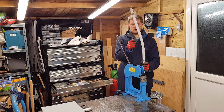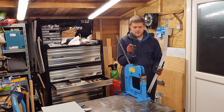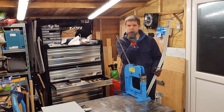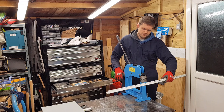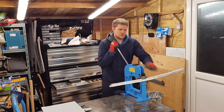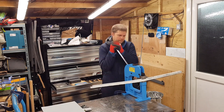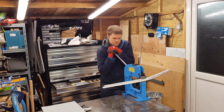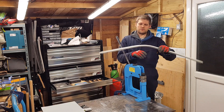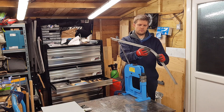You can see there — I've shrunk this section. These are shrinking jaws: as they come together, each jaw has two separate parts and they pull together. There's a separate set of jaws which does the opposite and pulls apart — I'll swap them out in a little while. I'm going to go back over this same section and see how much I can get it to shrink. So quite a bit of a bend in there. This will be good for around door frames, door apertures, window apertures, and making up repair panels.